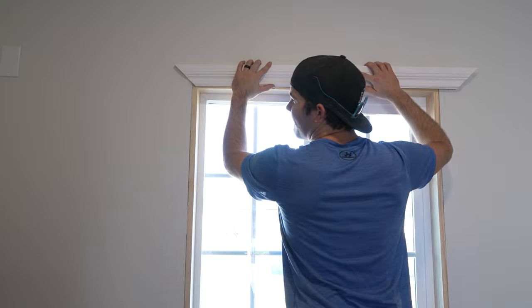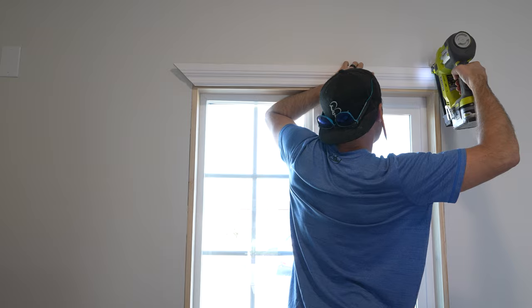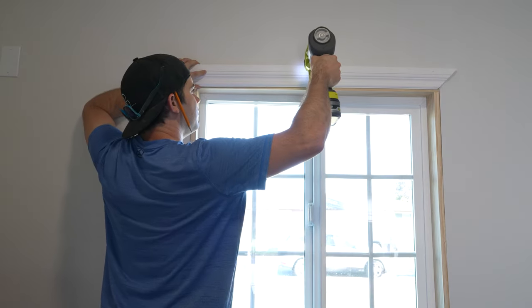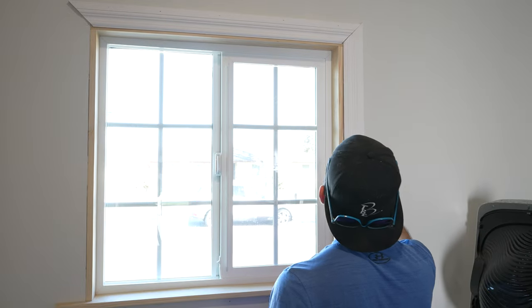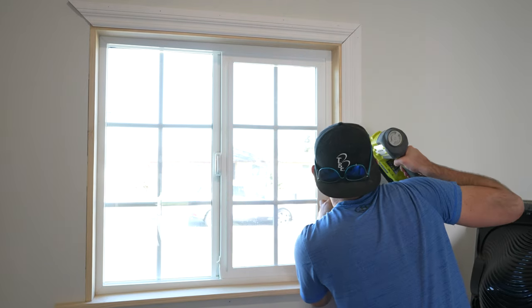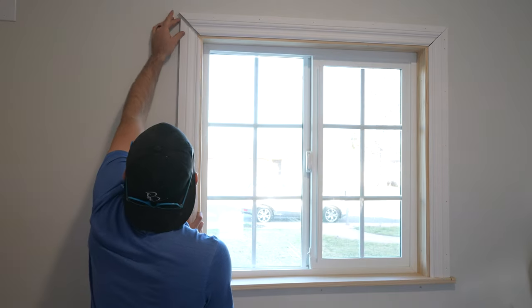On the face of the wall, I'm putting decorative molding. I divided up my pieces ahead of time with miters. Now that the interior trim is in, I can mark and cut the pieces to the exact length. These pieces will overlap about half of the new wood trim. The side pieces have a miter at the top, and the bottom butts up to the overhang piece.